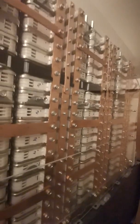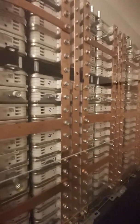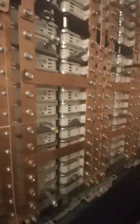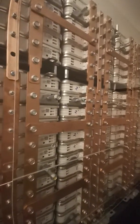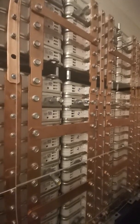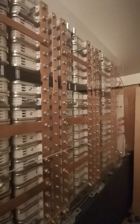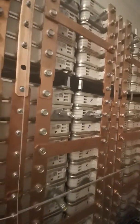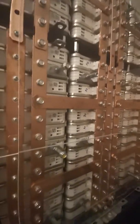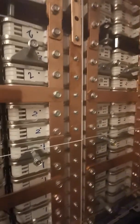If you want to add on later — like with these, I added on and put in a joint where initially I think we had about 14 or 15 and we increased it to about 20. I've got interconnects between the stacks — you can see I've got three in these. If you take an amp meter and measure the current when you're drawing a load, my charging goes up to about 230 amps and discharging sometimes up to 120–140 amps. With the three interconnects, the amperage is divided by three, so when I'm drawing 100 amps it's about 33 amps each.